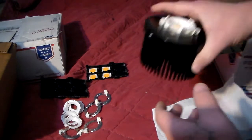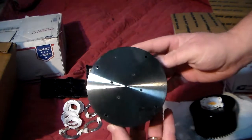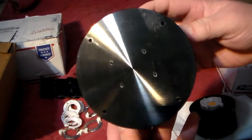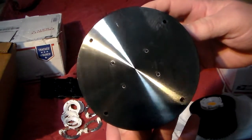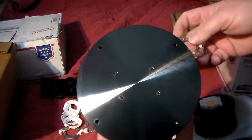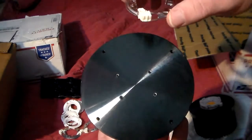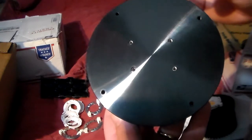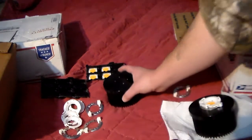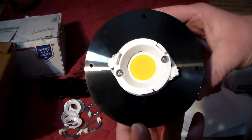Here is one of the 105 millimeter pin heatsinks — you can get these from cobkits.com. They are pre-drilled for the COBs, sized for all Citizen CLU 048s. They'll all fit with the ideal holder right on here. They're pre-drilled and tapped, pretty simple for assembly. I started on these and did a couple of them — here's one I assembled.